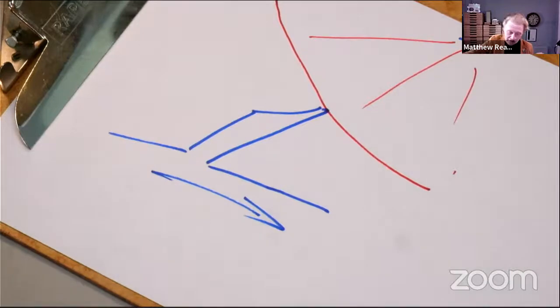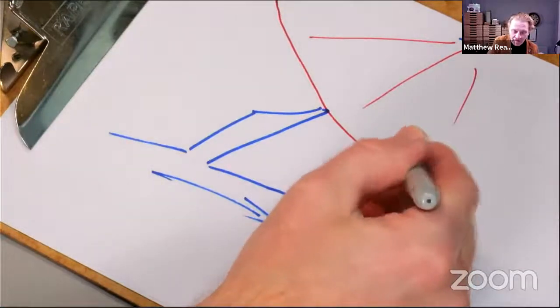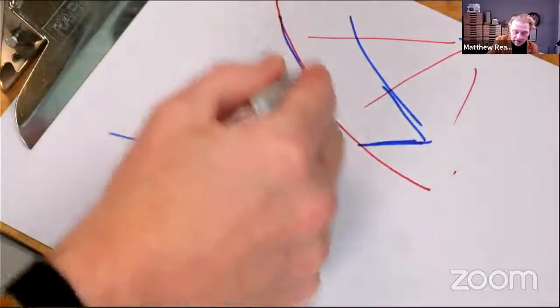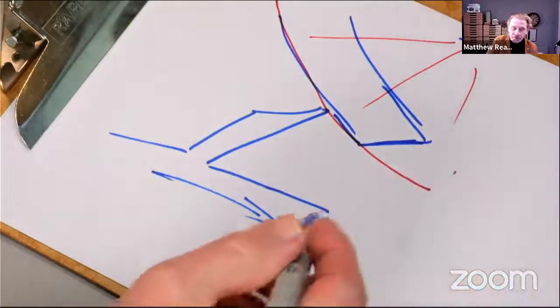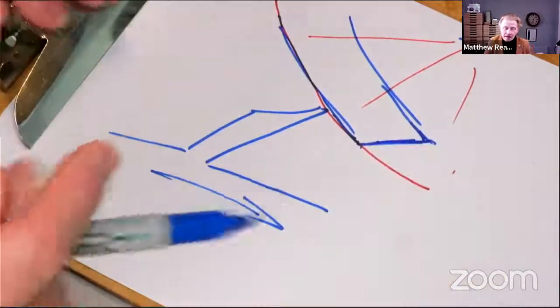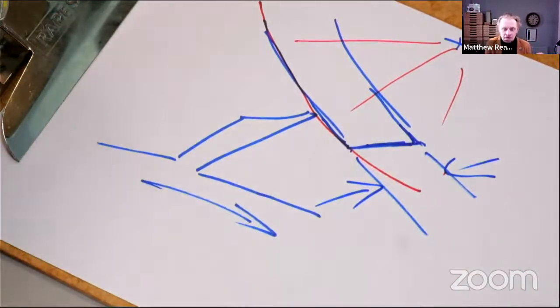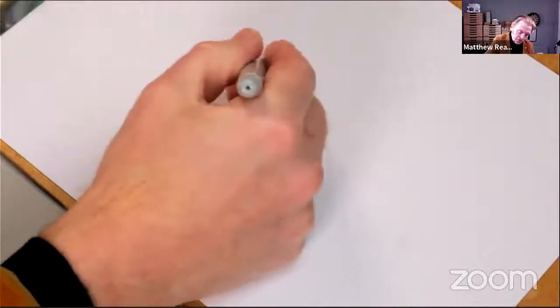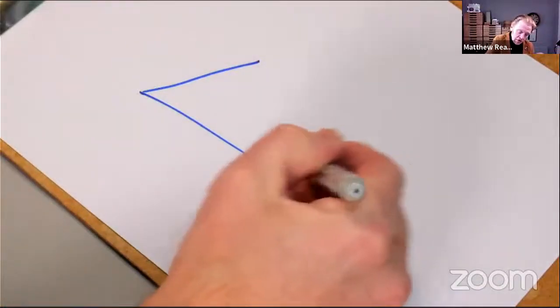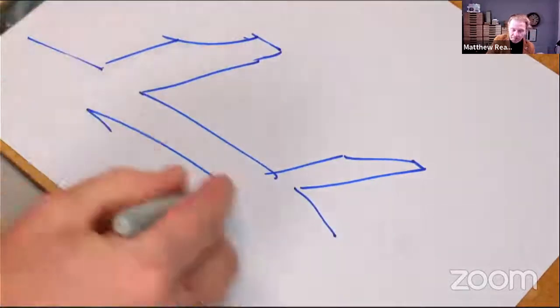And then our deadbeat pallet, so I've drawn the pallet arbor in a funny place, doesn't matter. So then we've got something like this. This is one of our pallets. The wheel would actually be going in that direction, but anyway. And so we have got this so-called dead face here and this impulse face here. And this value is important to us. The kind of thickness of the pallet is important to us in a deadbeat escapement, because if we draw two teeth, two escape wheel teeth like this, there we are, escape wheel going in this direction.